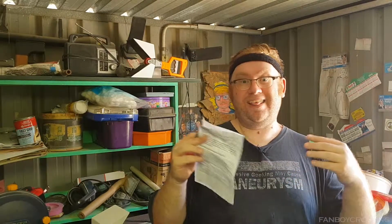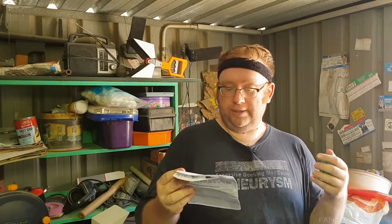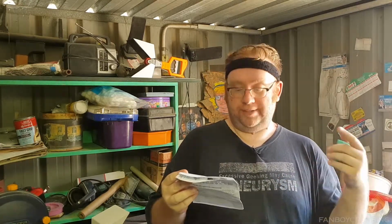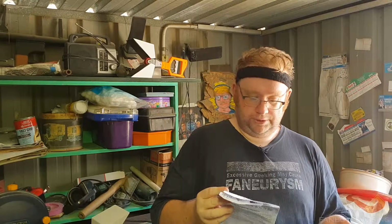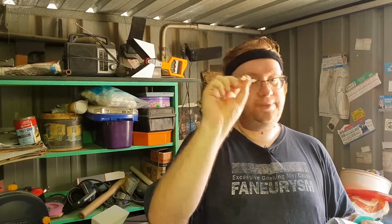Now K isn't just a letter, it means 1000. You even have 1K0, 1K5, 1K2. That means it's 1000, 1500, 1200. 4K7, which is 4700, 15K, 10K. These are important. Now, you sometimes will get multiples of the same ones, and these are easy because then you just go, oh, that's two of them, that's marked off.